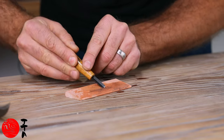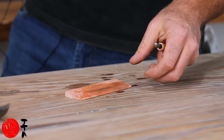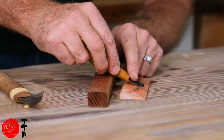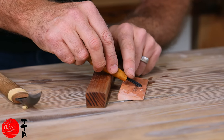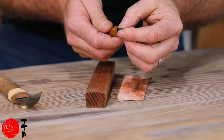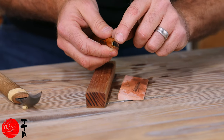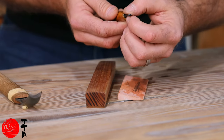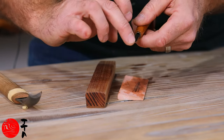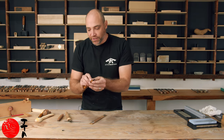If you find this too hard you could just get a piece of timber as a reference, find your bevel again, and keep going until you've got a nice even finish. If you've got chips on the edge you can just keep going until you've got a burr on the surface.